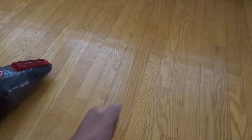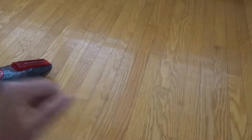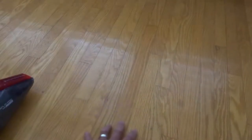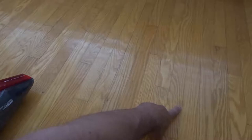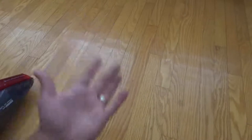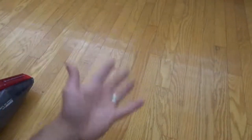So it's important to vacuum your hardwood floors with a regular vacuum at least once a week. And then if you see any significant dirt spots, just use a mini vacuum like this to vacuum them up. That's going to keep that dirt from dulling down the hardwood floors. In addition, if you see a water spot or a stain like this, you want to get rid of it right away. Just get a wet cloth and wipe it away and let it dry.